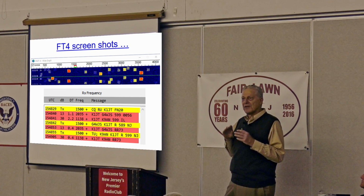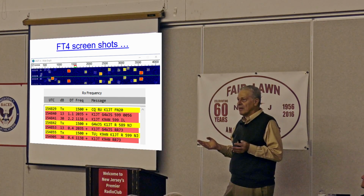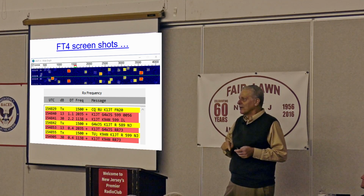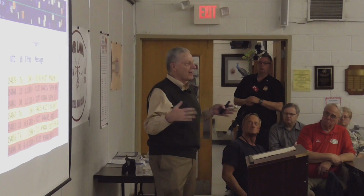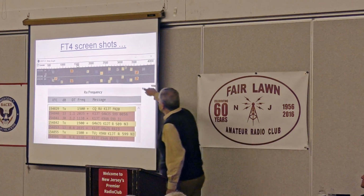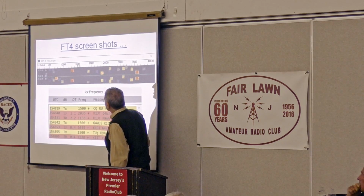It doesn't have a fixed cycle of transmitting and receiving. So it receives all the time until you hit F1 or some other key to send a message, and then it sends that message, and then it stands by and listens again. So notice that these signals start any old time. They don't all start on a marker. They can start any time.